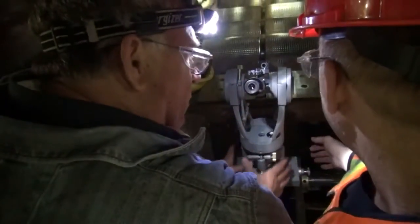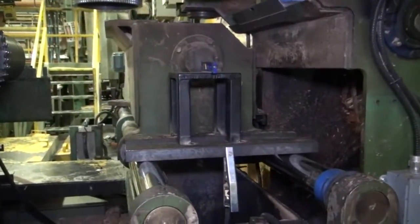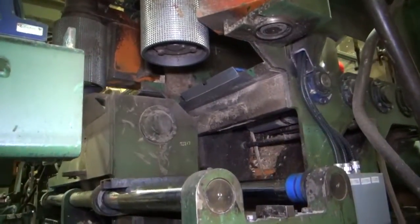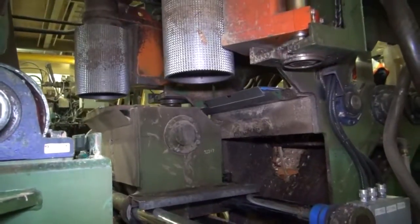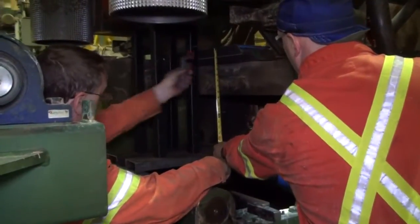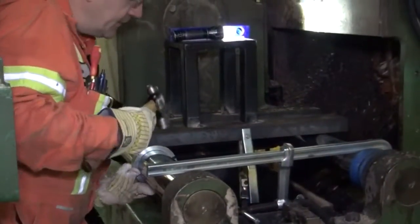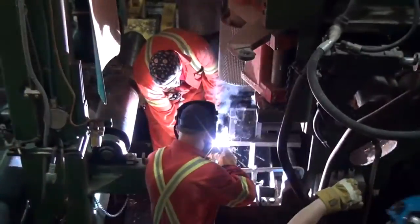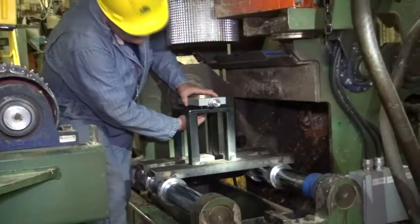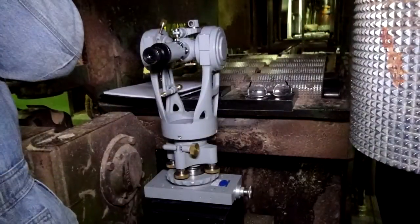A metal base is fabricated to mount the instrument in the machine center so it can see all the desired measurements. The instrument location for this project will be the outfeed end of the cutting section, a common position in primary breakdown lines. The top of the stand is set approximately 15 inches below the desired instrument height, which is typically the center of the log. The stand is fixed securely to the machine frame — in this project, welded to the chip head rails. The cross slide easily attaches to the base with a 5/8-11 bolt and provides lateral control to precisely align the instrument on the machine's centerline.